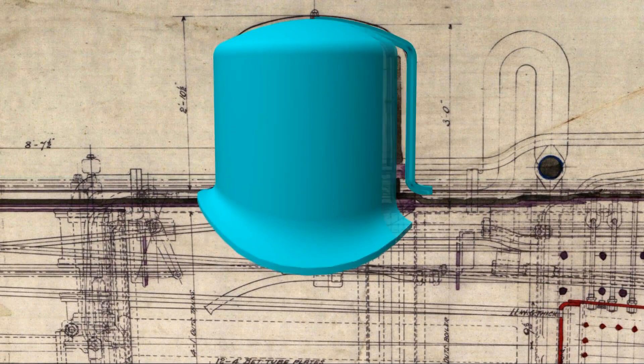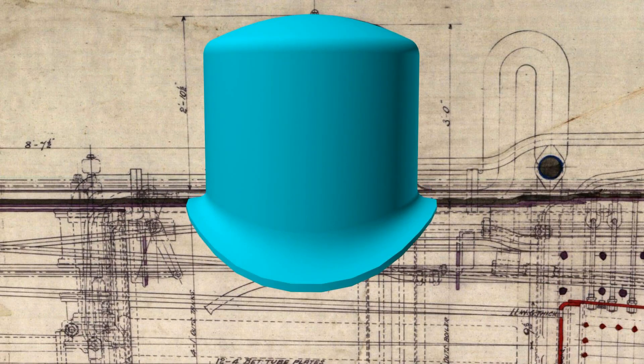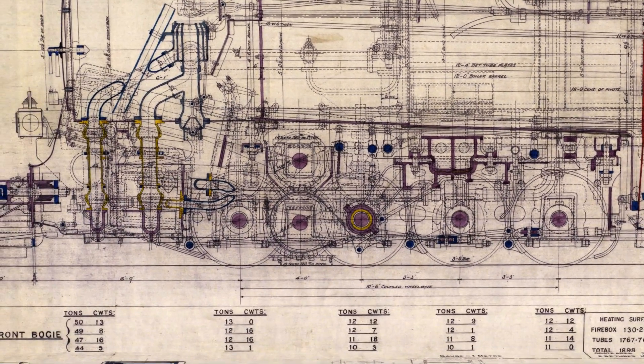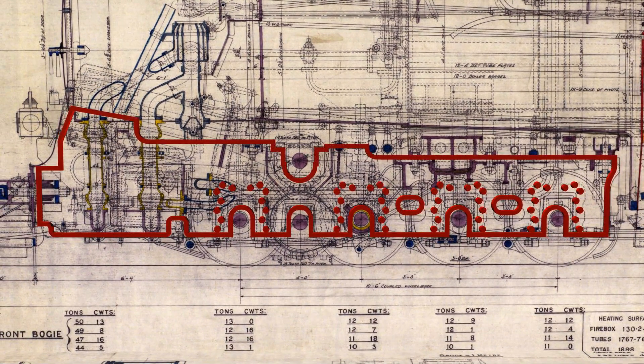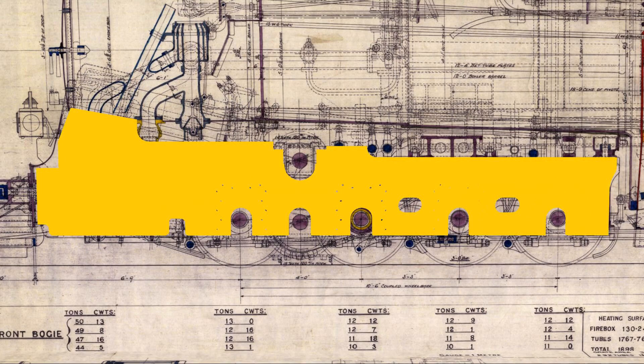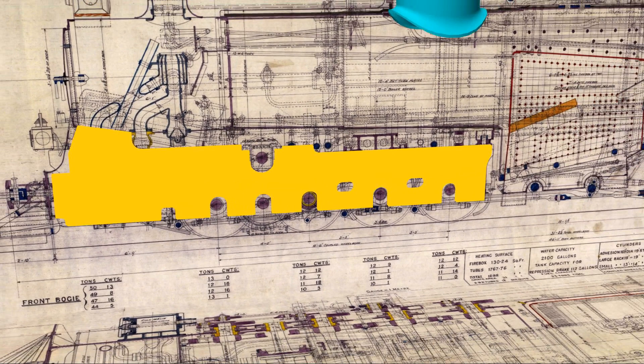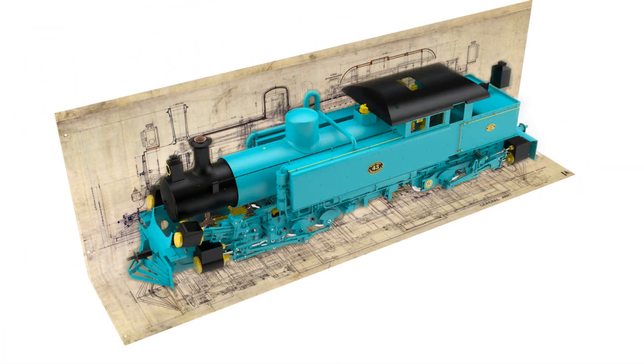Castings, or rather parts that have volume, are drawn as a 3D object with volume. Parts that are made of sheet metal are drawn as a contour and then extruded. Tolerances are adjusted according to the functionality of the model. Every screw and every rivet is marked so that complete material lists can be generated.